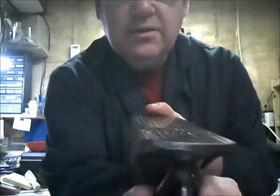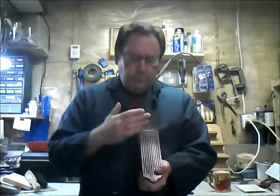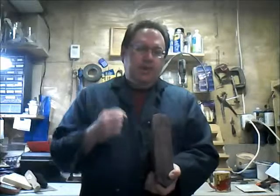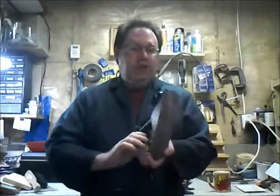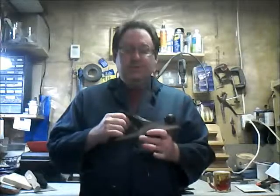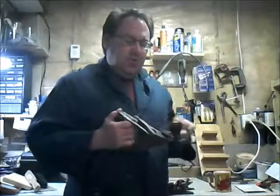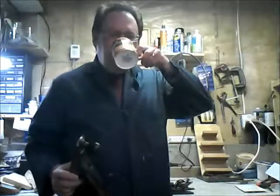Now we're going to be ready to go. Make sure it's even all the way across, make sure it's out just a little bit, and you're going to start your planing. As you're planing, if you find you're not getting any shavings, that simply means your blade's not out far enough. If you're jamming and it's chunking into your wood and you can't get any further, that just means your blade's out too far — make your proper adjustments. So that's our plane, the plane truth for today. I certainly hope that you have a great day. Good luck with your planing, and we will see you next time. Bye.